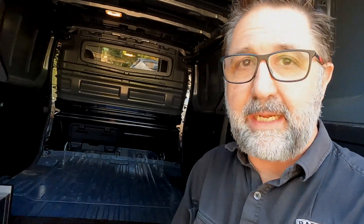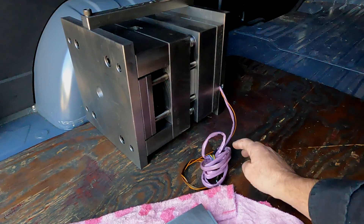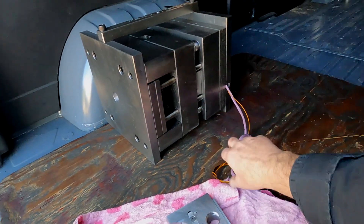The plan now is we've got to get the tool out of the van, hook some water up to it, run a hot sprue in the top, and dry out a bit of ABS plastic — because the originals are actually made out of ABS. ABS is acrylonitrile butadiene styrene, one of the styrenics like ASA, styrene, polycarbonate — all in that family. We're going to use one with a good amount of carbon black in it. Carbon black is a really good UV stabilizer.